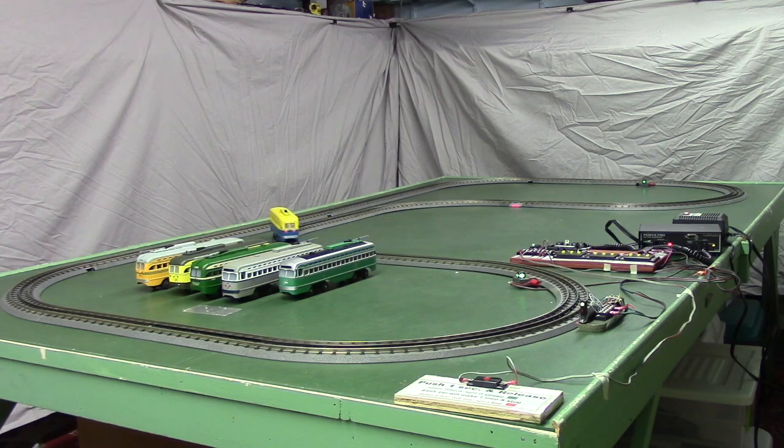And what happens, the processor, the programmable controller, slows it down to speed step 1, and it's checking the other cars to run, except there are no other cars to run, so it goes around the loop in the program and comes back to this car and starts it up again.